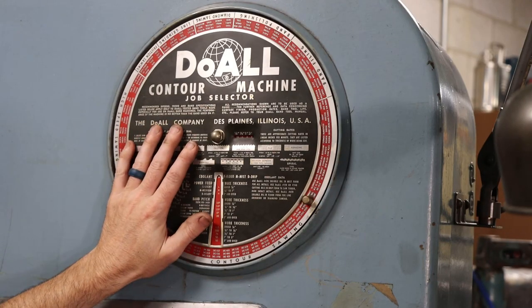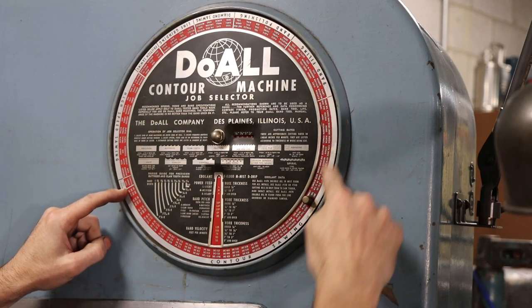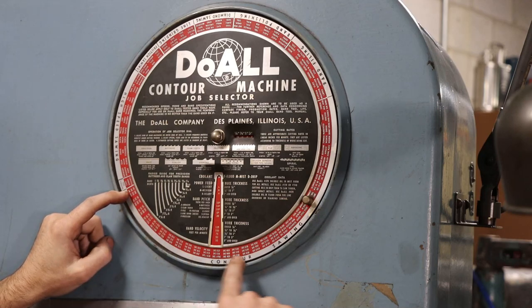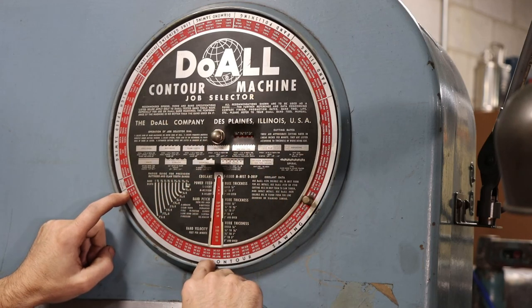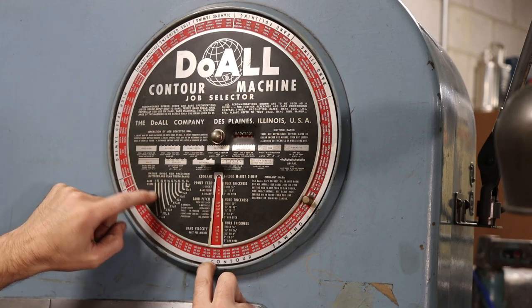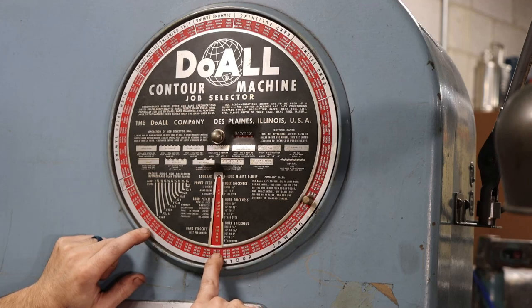So this really does complete the look of the saw. Not only is it useful, this is probably the most used piece of the chart that I'll be referring to. It's a contouring section, and that just gives your basic grades of steel, suggestions on your speeds and feeds. This chart also gives your maximum radius that you can cut given a band's thickness or width. And right now, this does not have 4140 on it, it has 4130.